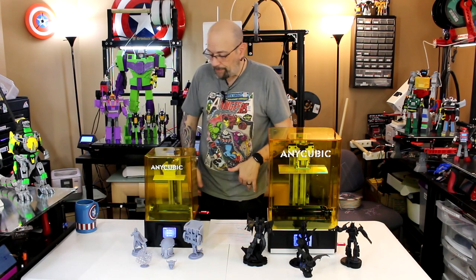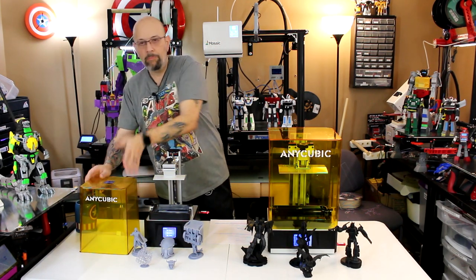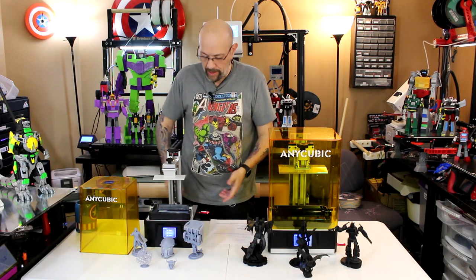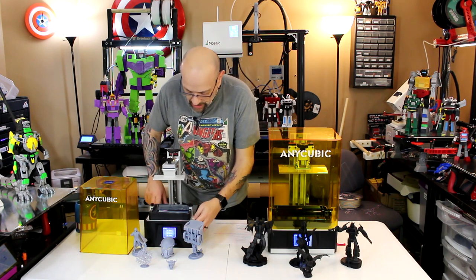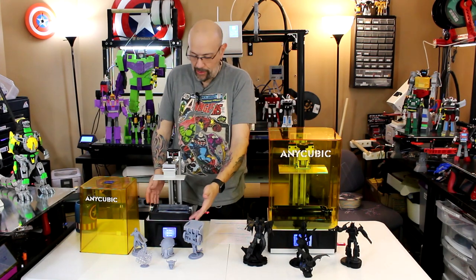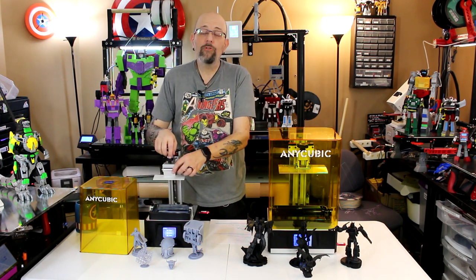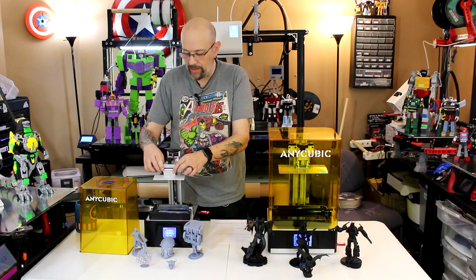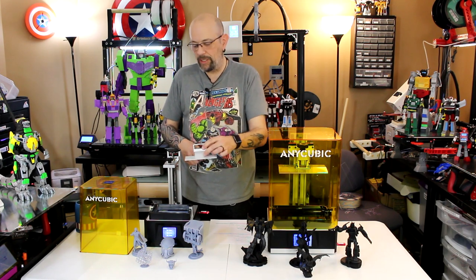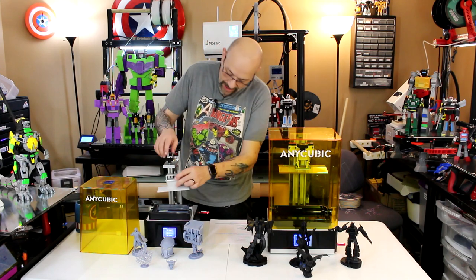I've already run them, there's resin in them, so I'm not going to show you the leveling — I've shown leveling on multiple other videos. If you really want a leveling and setup video, post a comment and I'll make one. What I do really like: they're nice and solid metal — the whole base is solid metal. The resin vat comes with a little pour spout, and there are lines inside that show you how much resin you have. They're much easier to lock down with just two little screws. The beds slide on and off and lock on. This machine has a single linear rail on the Z, whereas the Mono X has a dual linear rail on the Z.